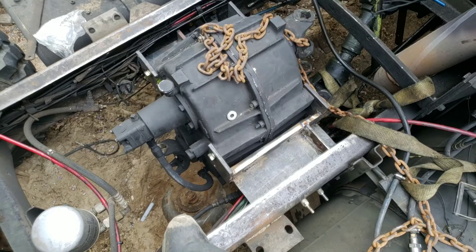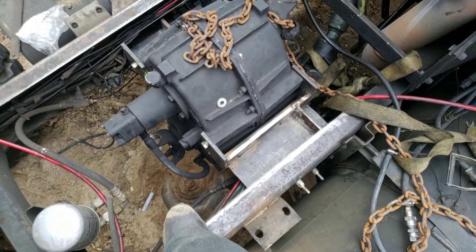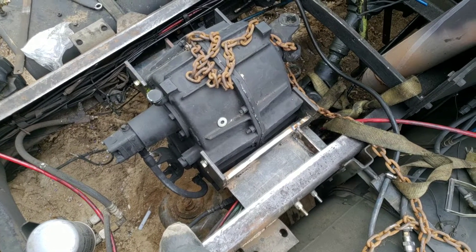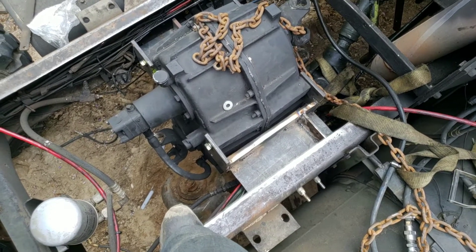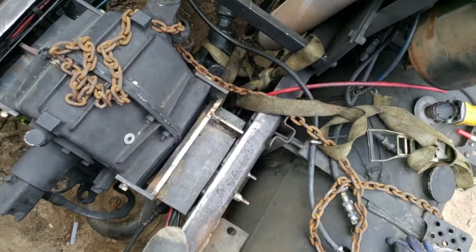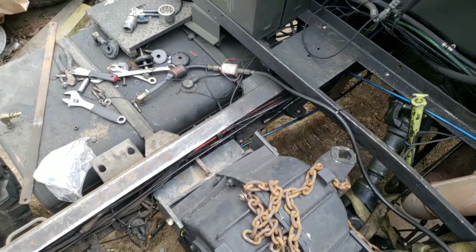Right now I'm just mocking it up. The brackets are made out of half-inch steel — I don't think they're going to break. There are probably 40 passes of 7018 rod in it, 7020 I think. So it should not break. There's one truss on it — this truss is offset because I wasn't sure where one bolt hole was going to be. I put in one truss and might add another later. That center truss is positioned so both mounts will clear it.